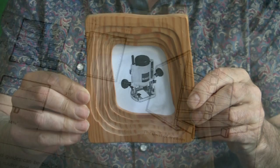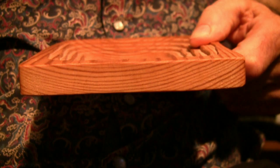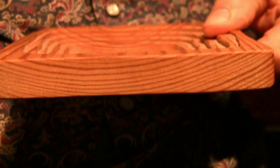Oh, a little observation and tip. If you're using solid wood and the annual rings are long, as you can see here, the wood will have a tendency to slightly bow, and the golden rule is the annual rings try to straighten out, so you can tell which way the wood is likely to bow. This example, which must be over 10 years old, hasn't actually bowed.